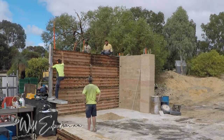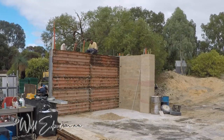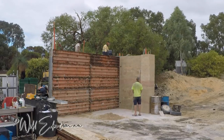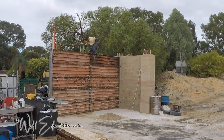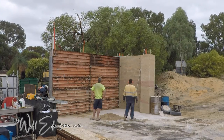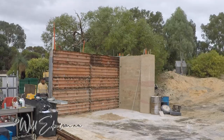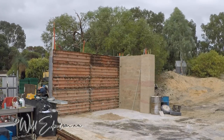As they come to the top of this form, up until this point there might have been a 100 to 200 millimeter gap between the mud and the top of the form when they already start putting new forms up. Now at three meters, our bobcat can't lift the mud any higher than a 2.4-meter form, so at its full height they have to shovel the mud in. What happens now is they fill the form right to the top and ram it, even though when you ram right to the top you lose a lot of mud out of the sides.